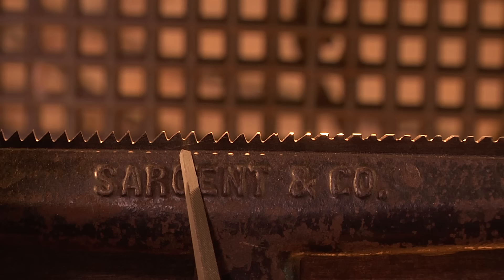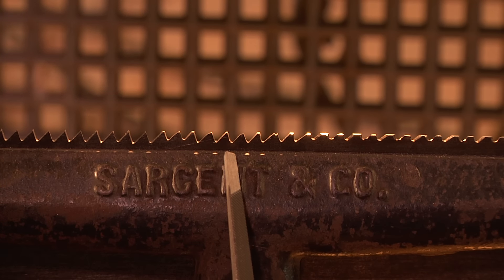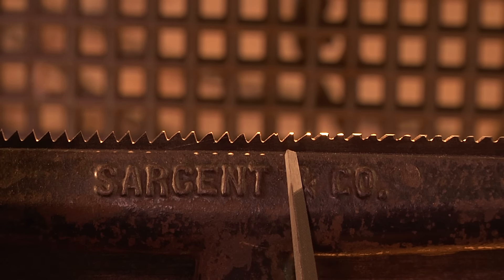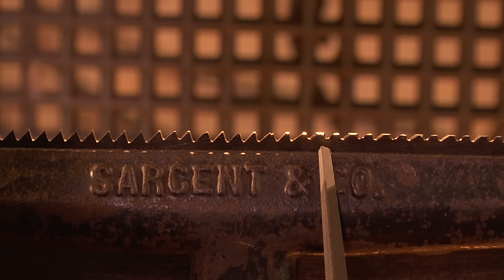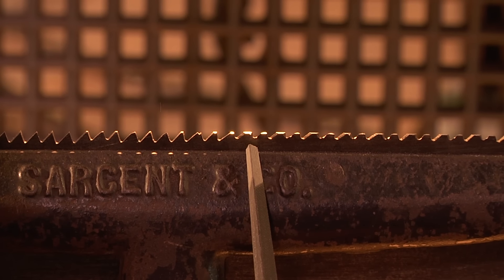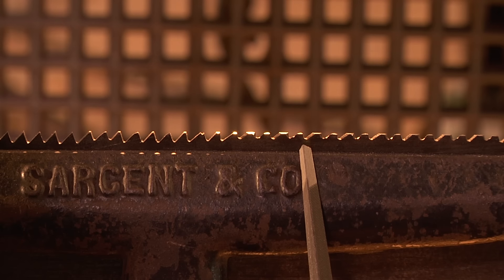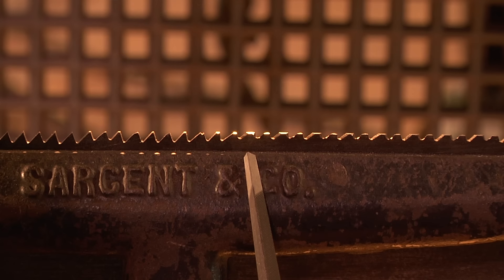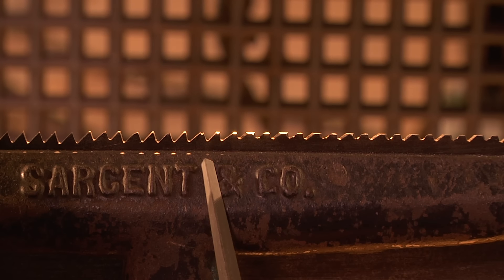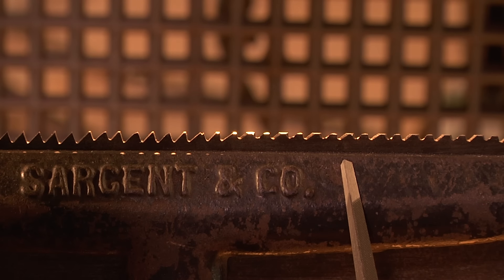As you get going down here, you can see that these teeth aren't anywhere near as deep — these haven't been filed. And going even further, look how bad the spacing is: there's a big flat spot on the top of this tooth, and the next tooth, while this one is very small, then another large one. That's all to do with how it was filed last time — it was pretty horrendous. So we're going to go right through in one pass, filing and straightening it right back out again.